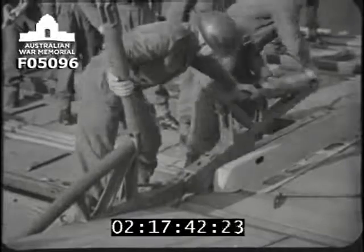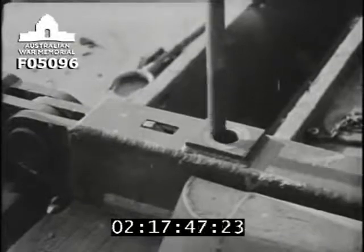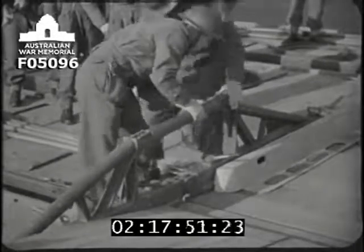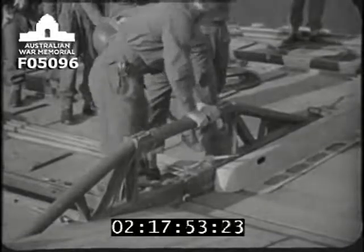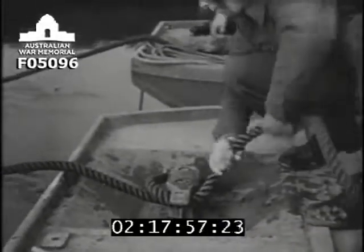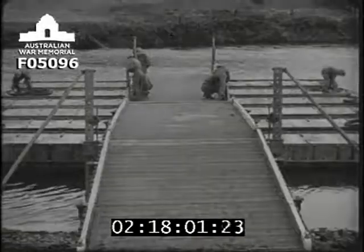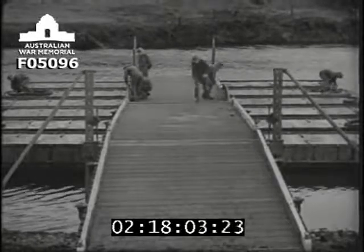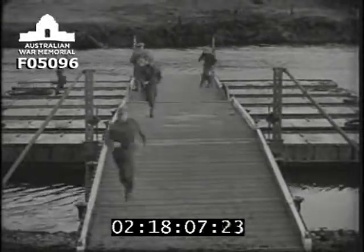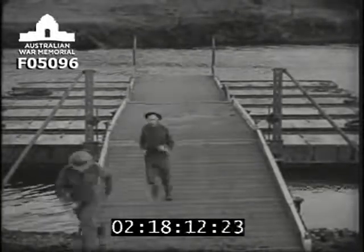The cables must always be kept under a bollard so they can be made fast quickly. The raft is then brought alongside the bridge and connected. The upright arm of the connector is released, lowered, the locking handle locked and the racking bolt screwed tight. The top strut is then lowered into place. All cables can now be taken in and made fast to the bollards with a round turn and figure of eight. A cable is used on each pier, but in a slow stream, one cable upstream and downstream for each raft may be enough.